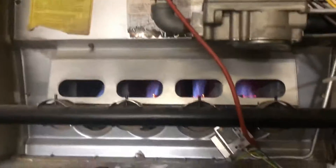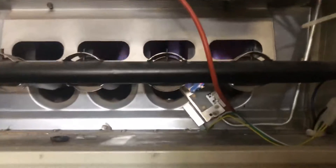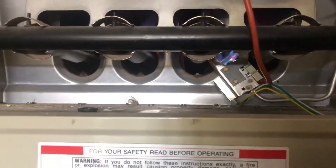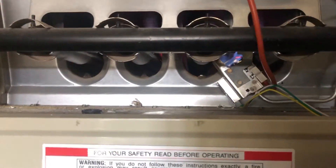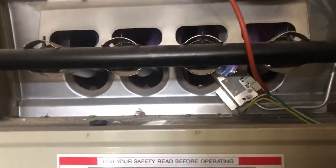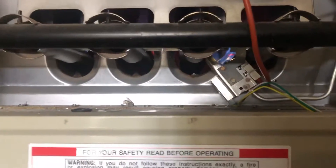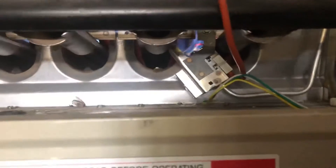I had no more issues. The problem I was having was it wasn't turning on — the blower motor was hesitating to start, and it would run once it got going. It was just making a funny sound, the igniter didn't want to start. So I replaced the igniter — cost me about $150. This is the igniter wire.